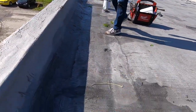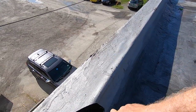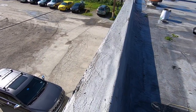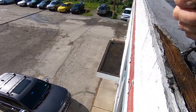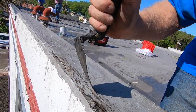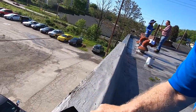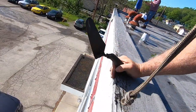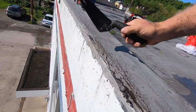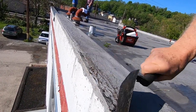The membrane comes up the roof and they brought it over to the parapet wall. The parapet wall is fine, but they stuck the membrane to the wall and it doesn't stick. Look how wet it is — this is cement and this is a rubber membrane, and it's coming apart. There's no metal edging, it's just concrete, and the rubber is separating.